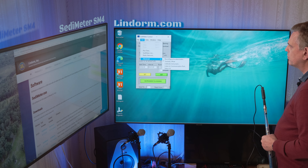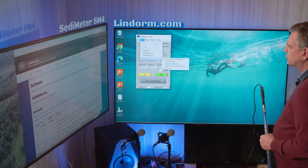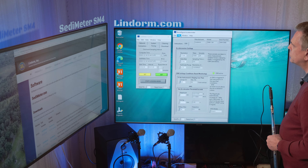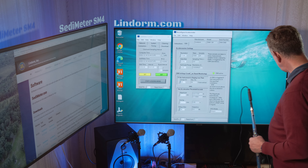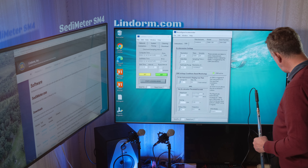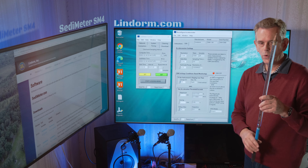Let's go back to Edit > Advanced > Reconfigure Accelerometer. It's better to stop logging first. Read the latest settings from the instrument. Down here we have the conditions-based monitoring settings. If you want to inactivate CBM, just click this button — it's the easiest way. It will put the threshold for slope at a level which can never be reached, which is absolutely impossible.